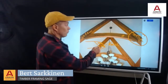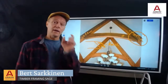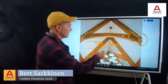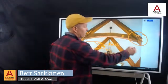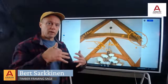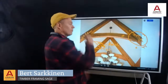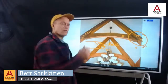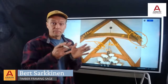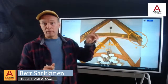The parallel to grain is usually a lot stronger than the perpendicular to grain, but the tenon is usually a lot narrower than where the mortise or the main beam is, because this here is, say, like 2 inches thick, and if your beam is 6 on the beam, well, you have double the wood that has perpendicular to grain. And so it kind of balances out. So just the connectors in the center, and you'll see this on industrial trusses that have maybe been built with glulams and metal plates. You'll notice that the bolts are either in the center or in a staggered pattern in the center.